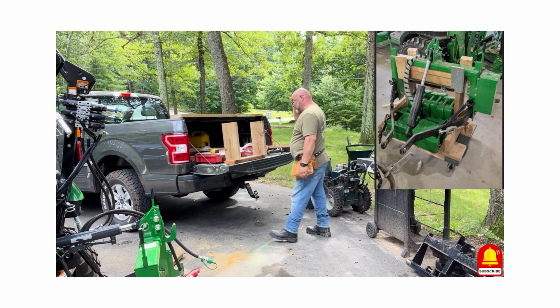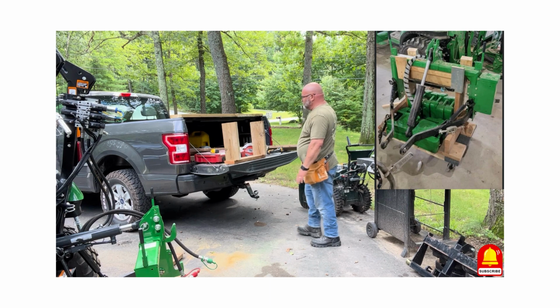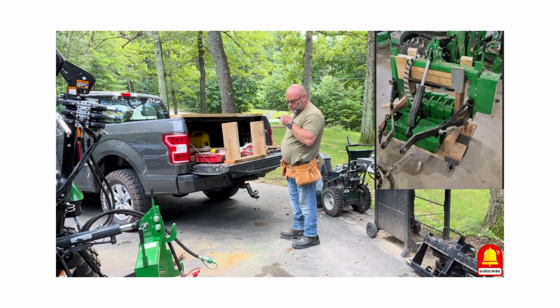Okay, so that's how it's going to sit. Then I am going to use 2x4s to make my top plate. So this is actually going to sit a little higher. What I didn't take into account was running my 2x4 across, which I want to put so I can screw it down so it gives me more side-to-side strength. That's going to lift me by 1.5 inches, but that's okay. Not the end of the world. It'll all still work.